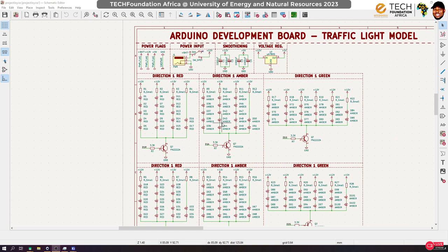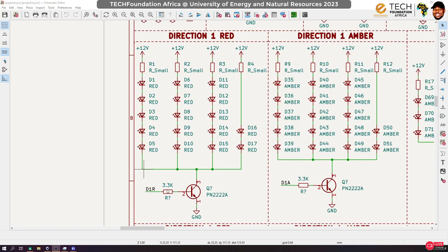Looking at the fact that our LEDs are powered by a 12 volt source, the Arduino, as we learned, when it switches, its digital pins can only produce 5 volts and 20 milliamps, right? If we clear this away and connect it to a 5 volt source, it wouldn't be able to power the LED modules up, because we need 12 volts and Arduino can give us only 5.